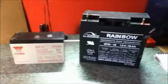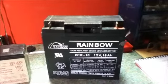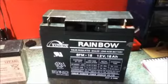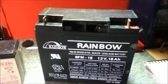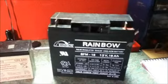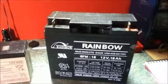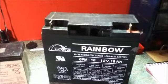The batteries shown here are valve regulated sealed lead acid batteries. These are AGM batteries, which stands for absorbed glass mat. The acid is held in a spongy glass mat, but it is not 100% saturated. There is no loose fluid in the mat, so if the casing gets cracked or damaged, there is no fluid to leak out. Also, flooded batteries give off hydrogen gas when they are being charged, and that is very flammable and in some circumstances can be explosive. So these valve regulated batteries recombine the gas inside the battery, so under normal conditions no gas is vented off, which is a good safety thing.